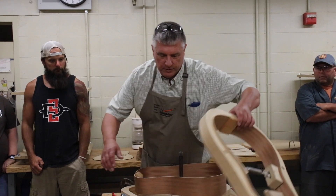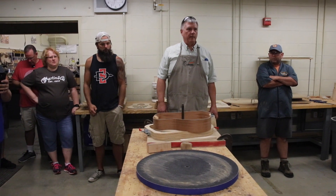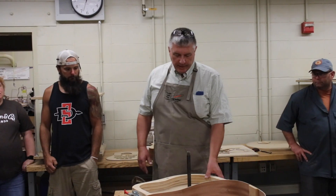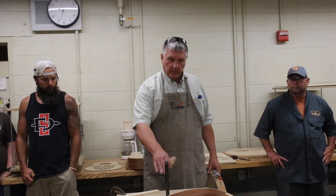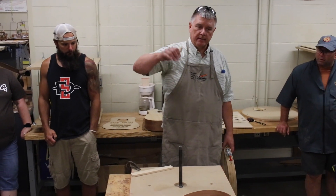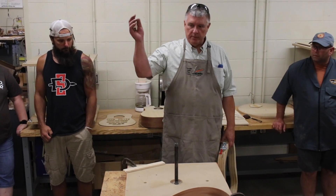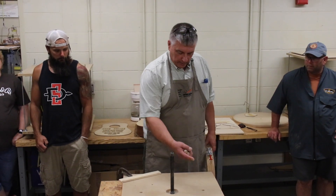This is what a radius dish looks like. That one has 40 grit abrasive paper on it and we're going to sand both sides. We have a piece of pipe recessed in here — the reason it's recessed is so you can stack them and they don't stick up. On the ones I have, there's a groove where the piece of pipe fits in with magnets so I can stack them and the pieces don't roll out. We do ukuleles, I do ukuleles, whatever.